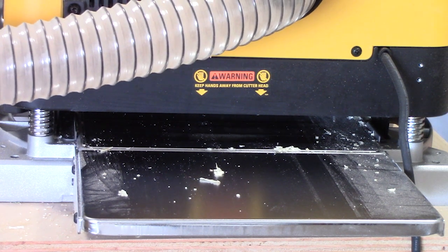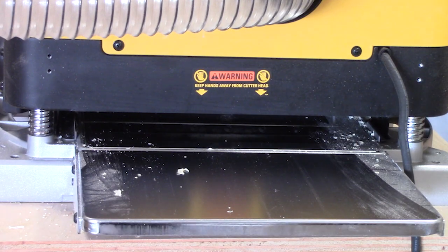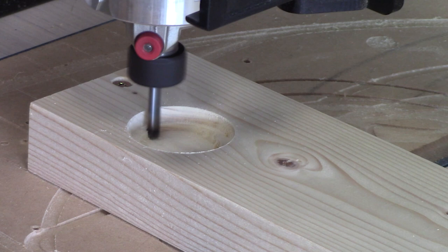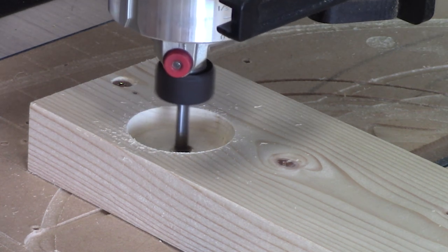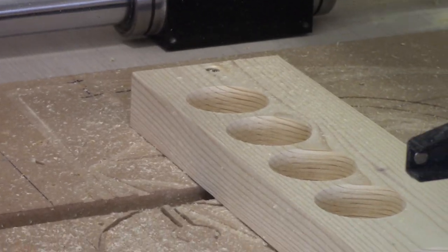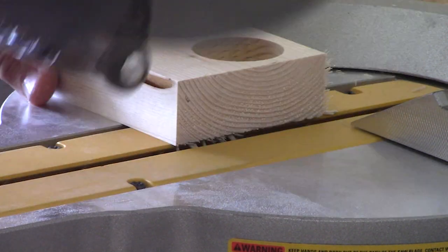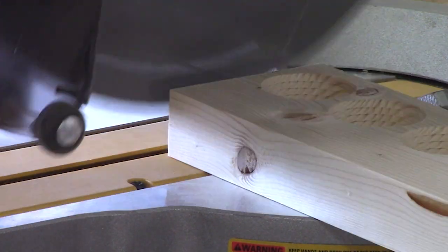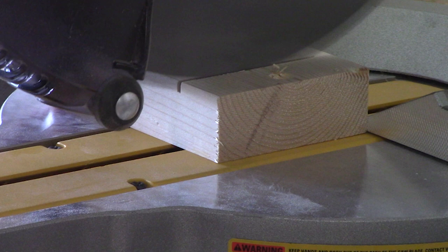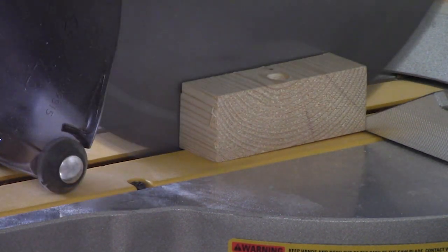From there, we're going to go ahead and plane down just a couple of 2x4s. I decided to try pine 2x4s for my trays, and they work just fine. I don't know what your philosophy is on combining hardwood and softwood — walnut and pine — but the finished product actually looks pretty good. I should probably use something like maple or oak. These pockets are going to be cut to whatever width you need based on the size jars you're actually going to be using. I'll place a link in the description for the jars I'm using, and if you download the design files, those match up with the jars I'm using. I actually made kind of a mistake — I shouldn't have cut my trays that close. I should have left a little more space so I could put the plug covers on them, but you live and learn.